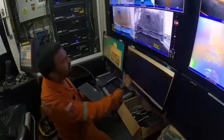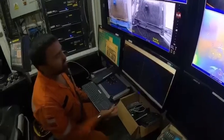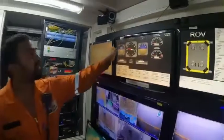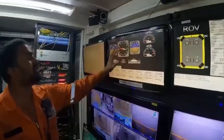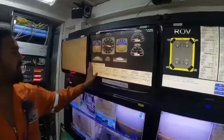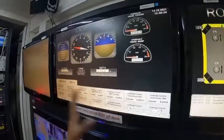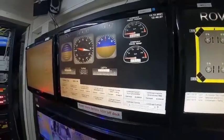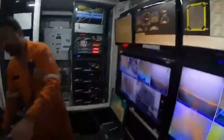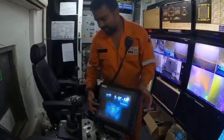As you can see, the sonar is sweeping now. But at the moment, the ROV is on the deck — we are not in the water, so we're not able to see much. Look here — these are the control SCADA systems for the ROV. It shows the heading of the ROV. Since it's an electrical ROV, each and every motor has monitoring of line insulations and leakage of current. This is the control system of the ROV — it's a Human Machine Interface, HMI. It's a touchscreen.